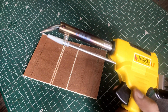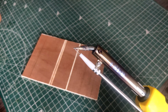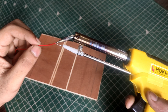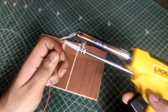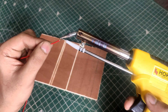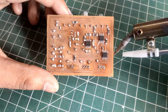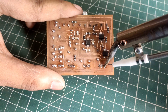We see some smoke from the tip, so the tip is heated up enough to melt the solder. Let's tin a wire using it. We have to adjust the silicone-like part at the end of the tube so that our solder hits the tip when it comes out. But once adjusted, it works quite well. We can solder using the automatic feeder with relative ease. It is quite useful as we can hold the PCB with one hand and solder with the other. Tinning the tracks is also quite easy.